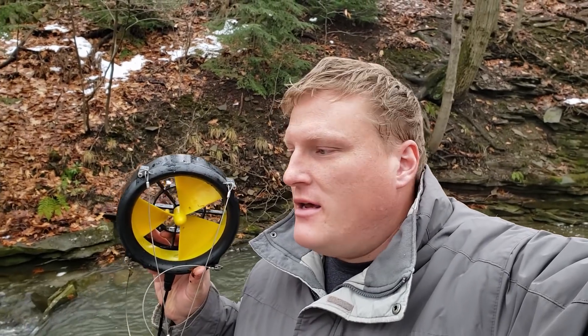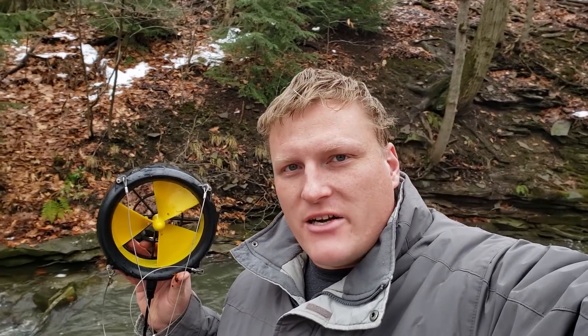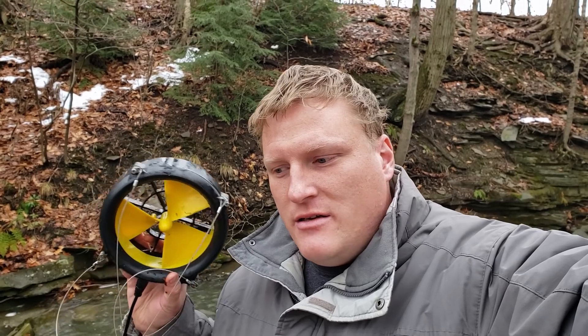That's it for this video, but I'm going to do a few more videos on this trying to increase the power output — maybe in a different creek or a significant river nearby. I'm also going to try hooking it up to my lathe so I can get different voltage outputs at different RPMs, and hook a fish scale to it to get the torque required at specific RPMs to output certain powers, so we can get an efficiency rating for the turbine as a whole. I'm also going to hook my leaf blower up to it to see if that really affects it, because it should be able to work in wind too.